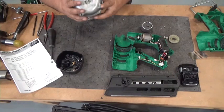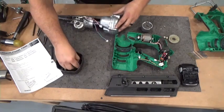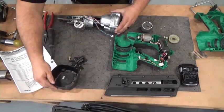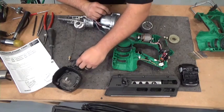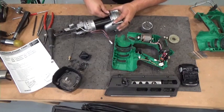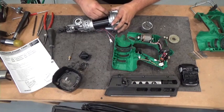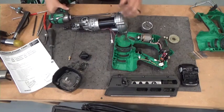You put the cap back on. The bolts back in for the cap. Dump those out so I can see them. Because now I'm going back into reassembly. And when you're doing this, do not pinch any of these wires. These wires are low voltage wires that can be pinched very easily. Also, so we remember, the white lithium goes on the piston. Regular gear grease goes in the pinwheel.